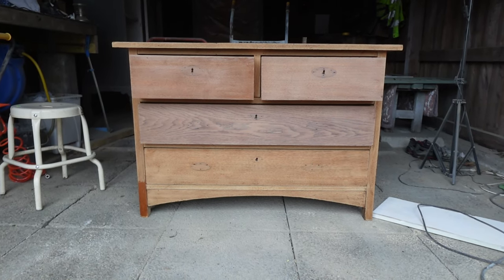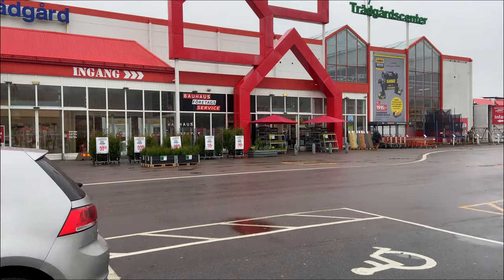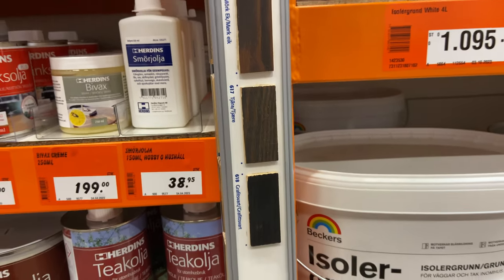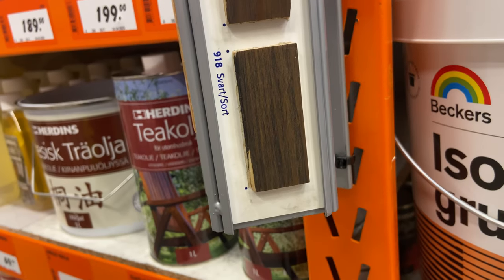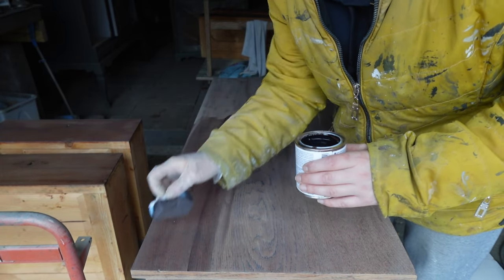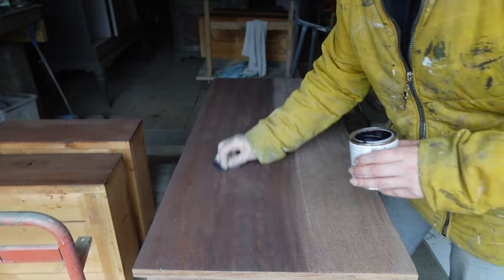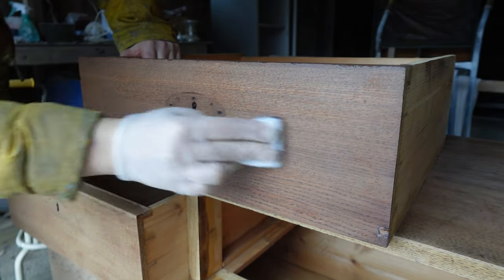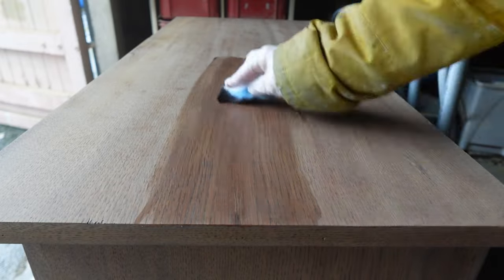Once the first layer of paint wash had dried I didn't really like the results — the wood was way too gray in my opinion, so I took a quick trip to my local hardware store to find a solution. I decided to go with a water-based stain in the color dark oak. Instead of removing the paint wash I had applied earlier, I remembered a technique I once saw on Instagram where someone applied the stain after the paint wash. As it turns out, this might be my new favorite technique because it gave me such a beautiful color. The best part is you can work your way up and decide how dark you want the wood to be by applying several coats of stain.